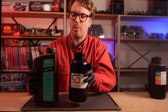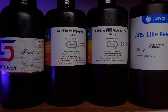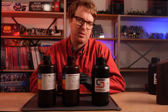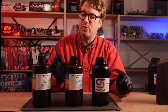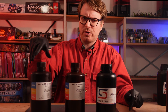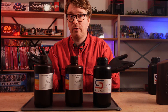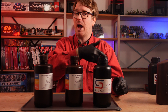What are you actually getting when upgrading from a basic resin to an ABS-like resin? For almost all of them, you get a bottle of resin where the experience out of the bottle is pretty good. A model without flimsy parts will be able to survive a fall from a table — not tough, but you can handle them without breaking. At one point I wouldn't recommend the Elegoo or Anycubic offerings of ABS-like, but with the newer versions they're coming out with, they are fine. And Siraya Tech Fast is a very common recommendation — I like it a lot. But it seems like they are all moving closer and closer together in terms of properties and value, almost like they all get their resin produced from the same few factories. Maybe the ABS-like resins are good enough for your use case — it's often what I use when I just print stuff.